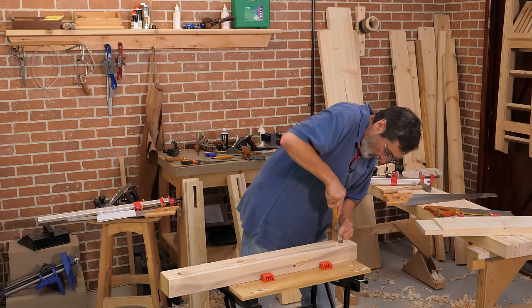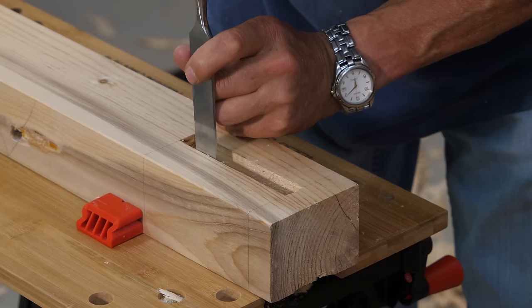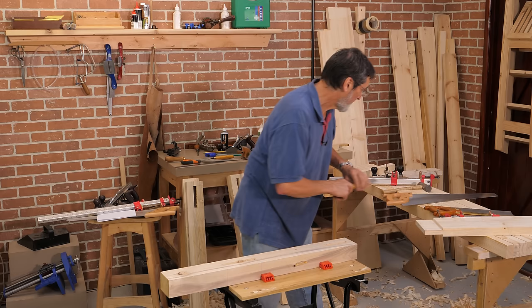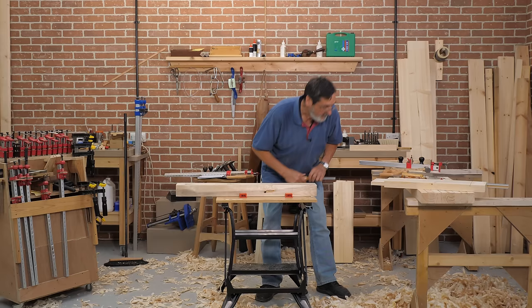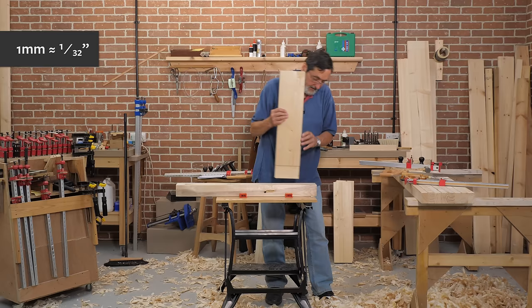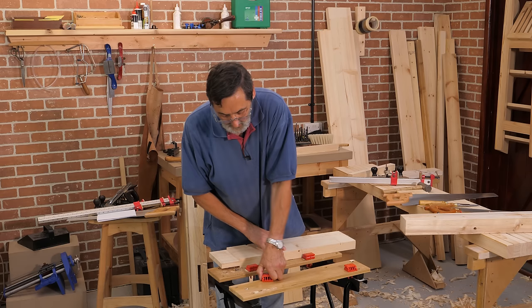Like this. That's it really. We're just going to knock out the remaining fibres inside there. And this is the time when you start to see where we made the tenon fat by that 1 mil on each side, and we have to take that down. So we're going to fit that to the mortise hole like this. I'm going to put this back into the clamp here, and I'm going to switch tools